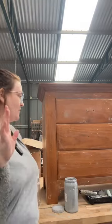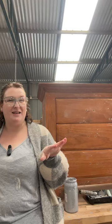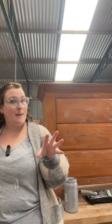Okay, so I've used my electric sander to sand off all of our filler. It was just quicker and easier. You can do it by hand, absolutely. It also wipes away really well, so if you've just got a damp cloth, that works really well as well. But we also needed to give this a scruff sand just to help our paint stick.